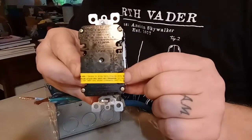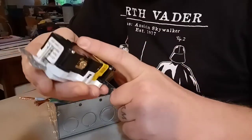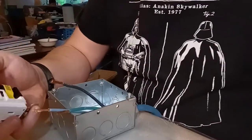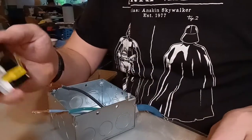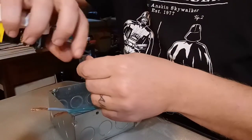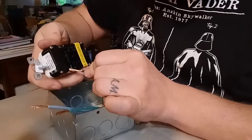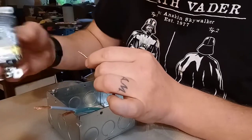This is the sticker on the back of the outlet — this is the line side that comes from the power source. So you take the black wire and it hooks to the gold screw. The way I always remember it: it's 'black gold,' like Jedediah Clampett who found oil on the Beverly Hillbillies. Make sure all the strands of wire get tucked in there so they don't touch anything and short out.